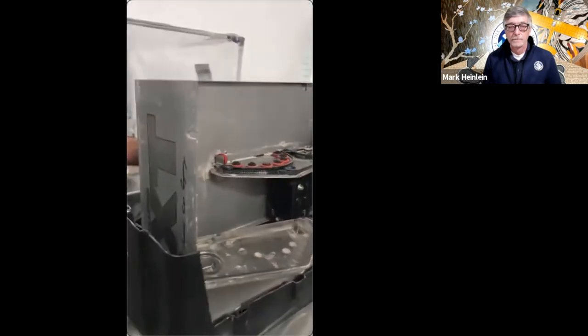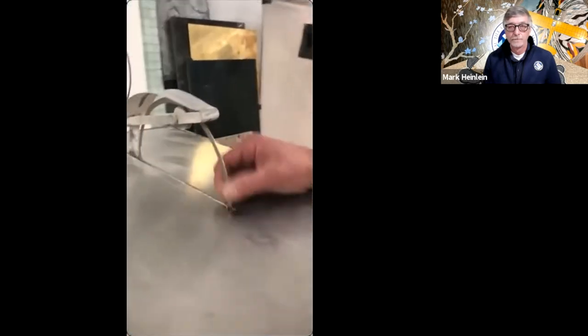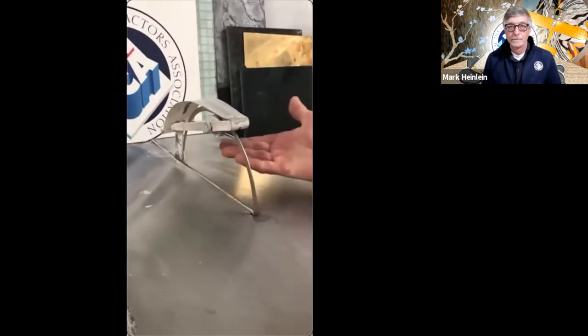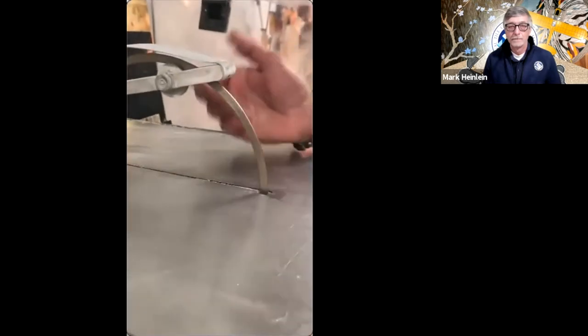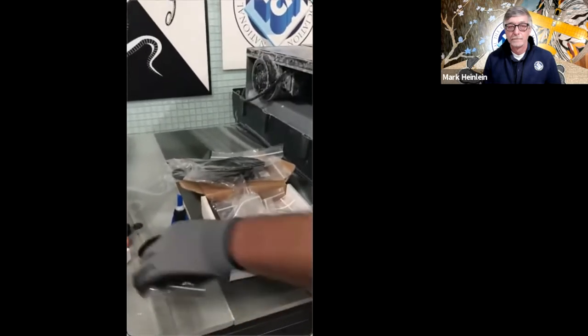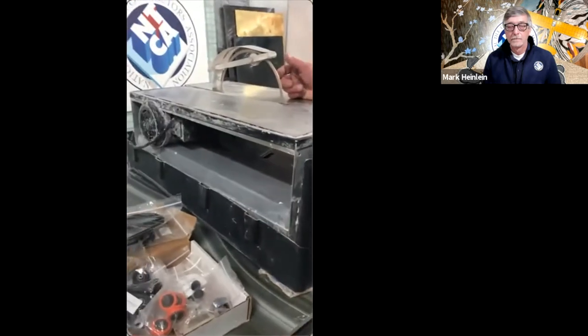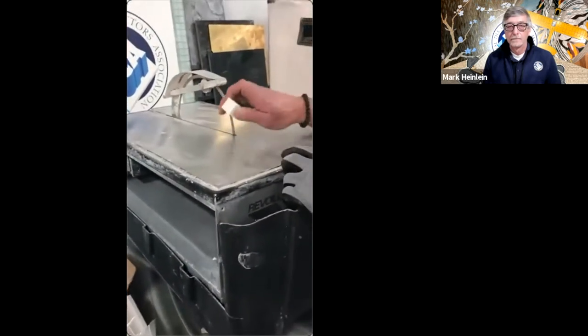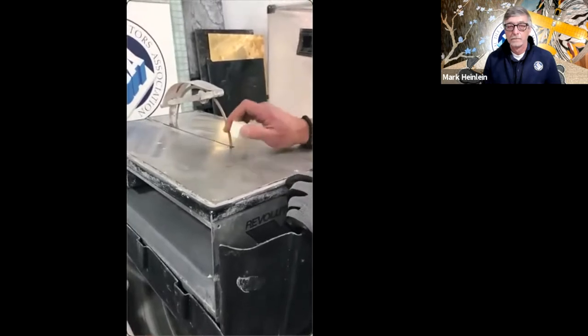On this one I have a glass plate. I found out that this blade that's wrapped double-sided is really the only blade you need — it replaces all the other blades. You can cut anything with it: glass, porcelain, quartz, stone, whatever. Just make sure you have spare parts so you're not frustrated when something goes awry. They say you don't have to dress this wrapped blade, but I still like to hit it once in a while because of all the different materials we're using in our projects.